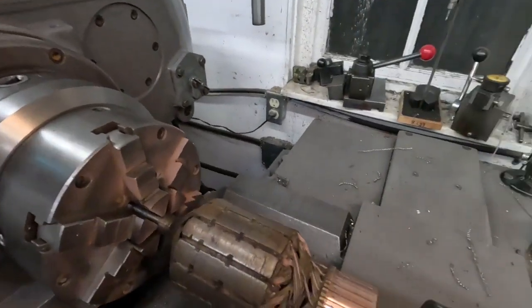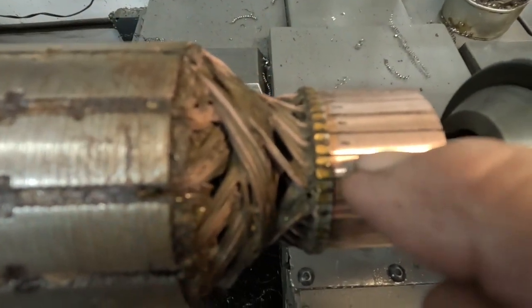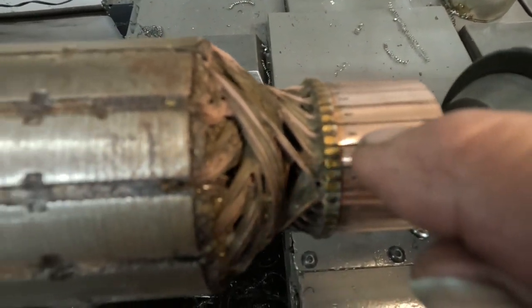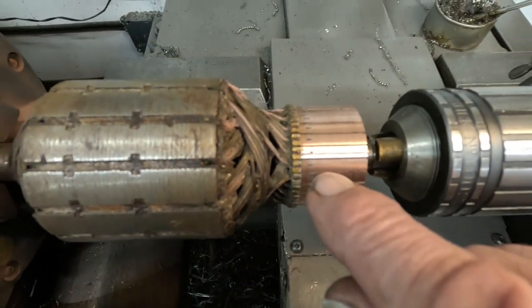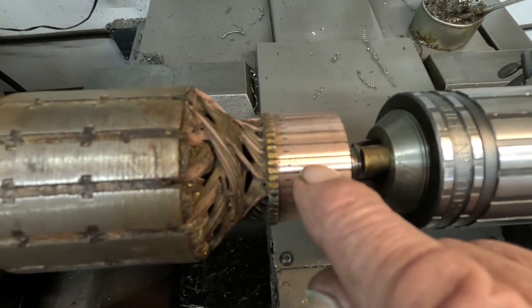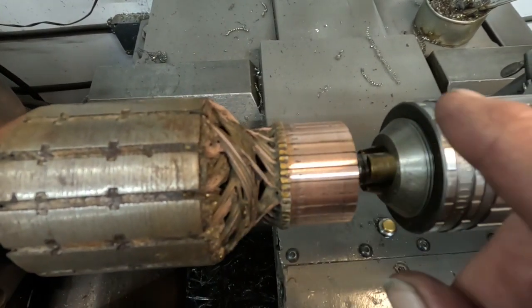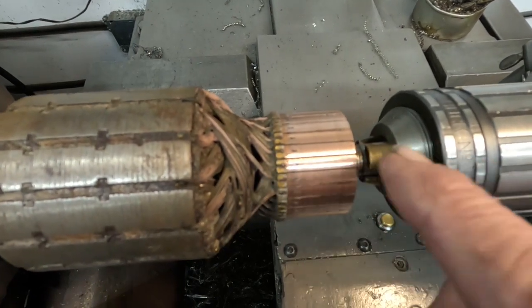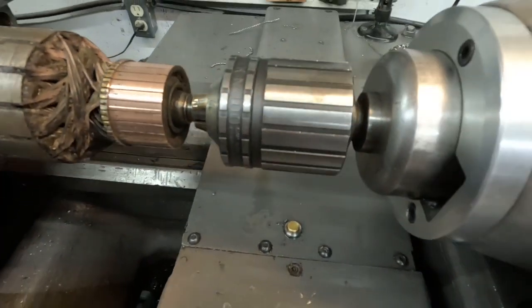Let's have a look. You can see that the copper has not smeared over the slots here. So using this method, it does not have to be undercut, but you want to look over it and just take a little pocket knife and flick any dust that's in there.